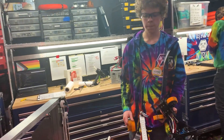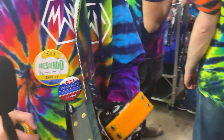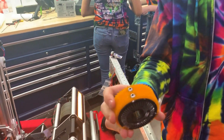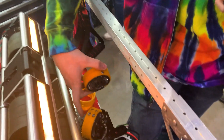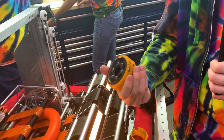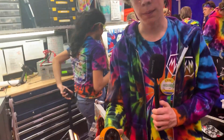Now we're going over to Elliot to talk about their unique wheel work. At the start of this year during the off-season, we developed these TPU wheels that are really cool. They have a spiky design which allows them to get about 1.5 times the traction with carpet versus normal wheels. The tread is bolted on, and we filed the edge of this ThriftyBot wheel that we bolt onto, making it hot-swappable — you just take out the middle bolt and pop out the wheel, making for very quick tread swaps. We spent a lot of time during the off-season perfecting this design, testing different TPU brands and designs, and this is what we ended up on for this season.